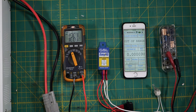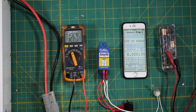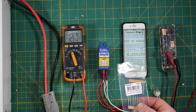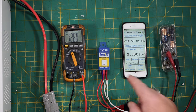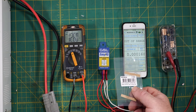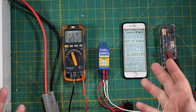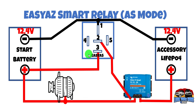Approaching the turn-off threshold now — there we go, in between about 12.7 and 12.6 volts it turned off. Interestingly if you don't have a load on the output you'll get ghost voltage on the output. If you want to fix that up you're going to need a pull-down resistor — these are 22 kilohm resistors. I'm assured by GSL the manufacturers of this relay that the later models actually have a pull-down resistor built in, so you won't need one across the output between pin 2 and pin 1.